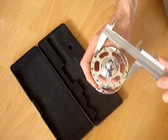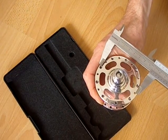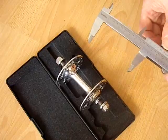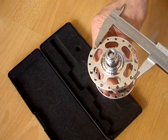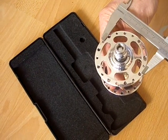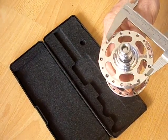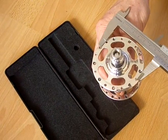If I move directly above there. Now this doesn't need to be deadly accurate even though you're using a vernier, and being 0.2 out doesn't really matter so much. You can move along to another hole just to check. And there you have your flange diameter measurement.